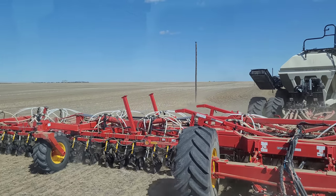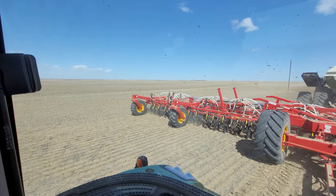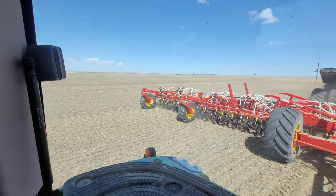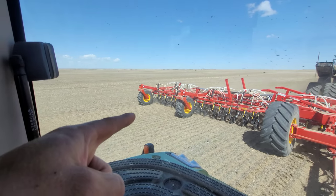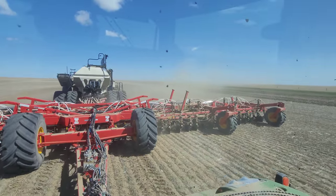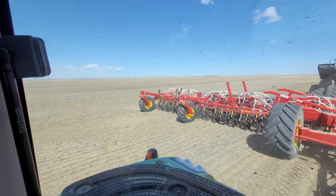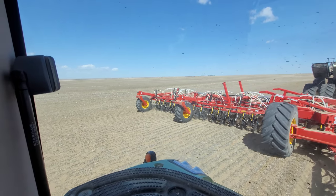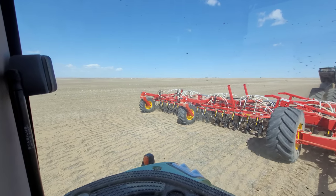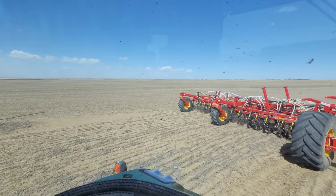What's the advantage of stitching them versus just doing a loop all the way around the power pole? Time. I don't want to spend a bunch of time looping around a power pole. And if you are going to loop around a power pole, you got to remember that the wing by the power pole is just about stopped, because you're going all the way around, but the other wing is going 100 miles an hour flying around the other side. So you got to slow down. Right now we're sitting at about 4.2 mph - that's a pretty good speed for stitching. I would probably have to go around these power poles at about two and a half miles an hour to keep that outer wing from breaking the sound barrier.